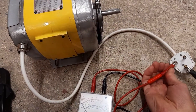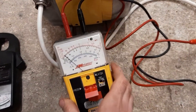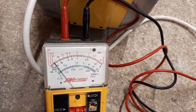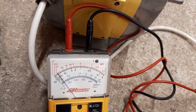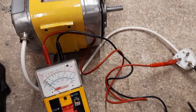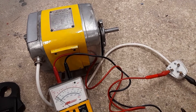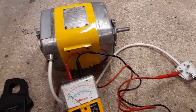There's probably a bad reflection from the lighting at the moment, but you'll see we're reading the top scale — the red scale — so it's greater than, well it's actually nearly 40 megaohms of resistance, which is very good. I've looked this up online and anything in excess of about 10 megaohms is regarded as adequate.